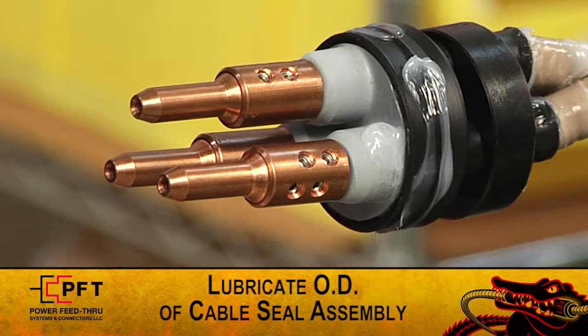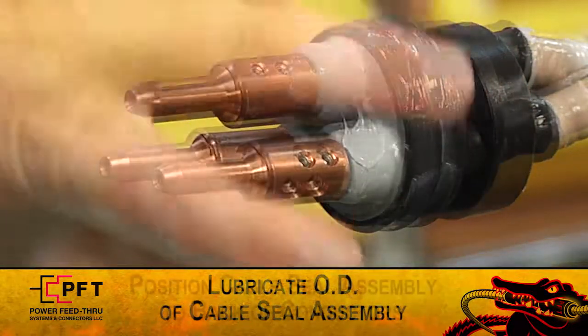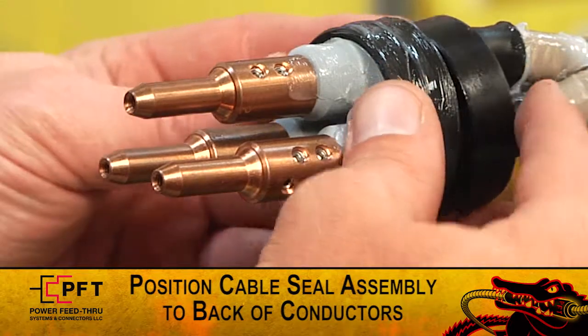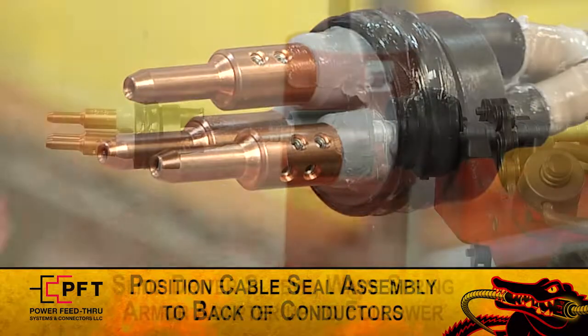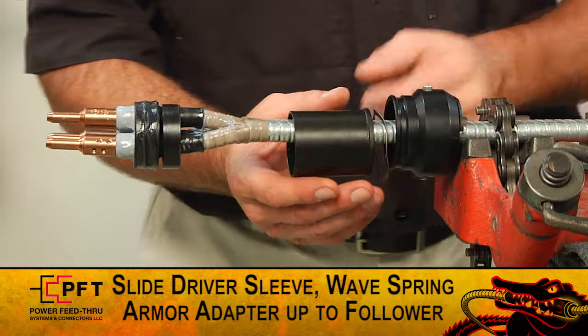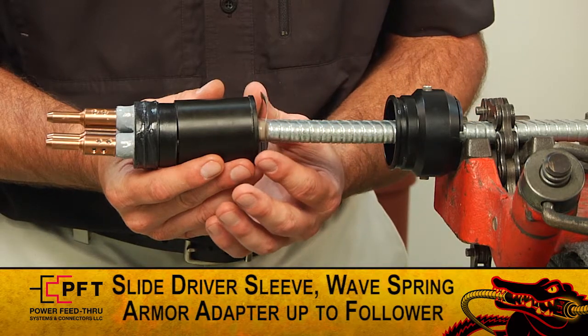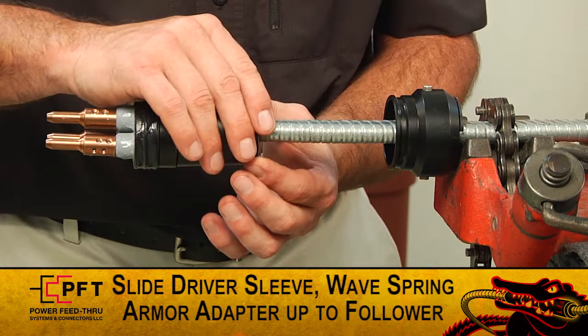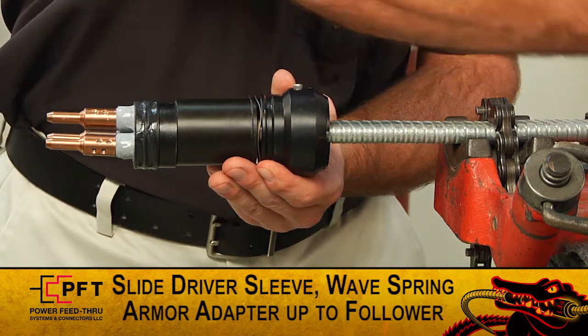Now lightly lubricate the OD of the cable seal assembly. You can now position the nose of the cable seal assembly to touch the back of the conductor terminals. Then slide the drive sleeve up until it makes contact with the follower. Now slide the wave spring until it makes contact with the drive sleeve, and slide the armor adapter until it makes contact with the wave spring.